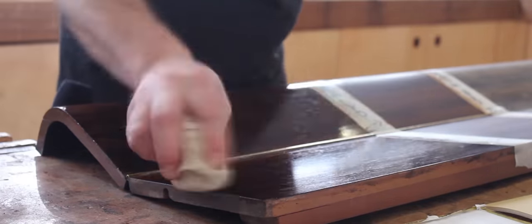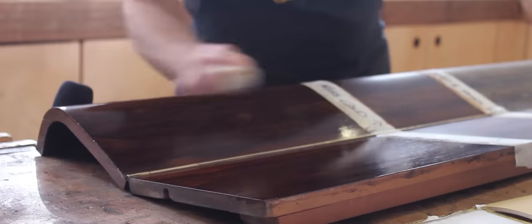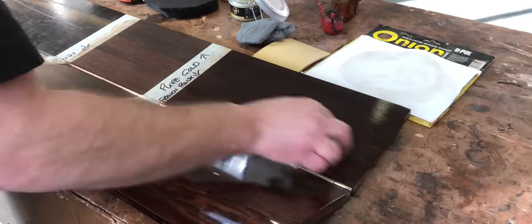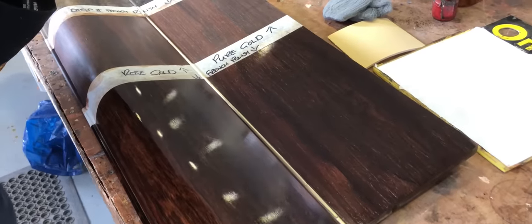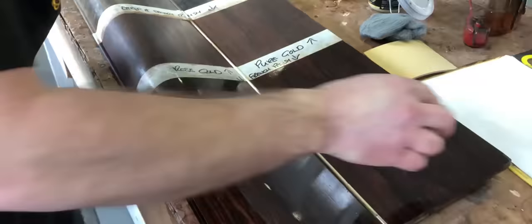In the same way as you would be bodying the surface, we use the same process for the spiriting. See, the face of the rubber is also quite white here, and it's got a lot of meths in it. See, that's moving much quicker. Look at that. There's a slight rainbow tint to it, but the actual area shrunk down much quicker.